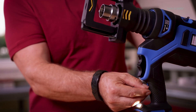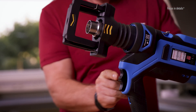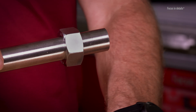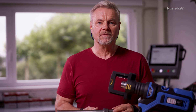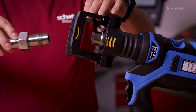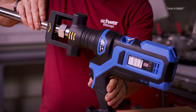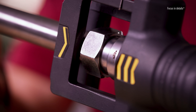Unlock the machine again and return the piston to its starting position. The union nut and the cutting ring are now pushed over the end of the pipe. The cutting edge must always point towards the end of the pipe. Ensure that the pipe is in the center of the retaining clamps and against the machine.